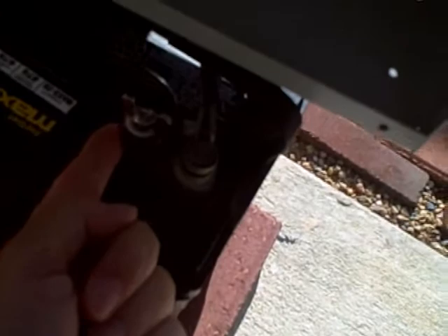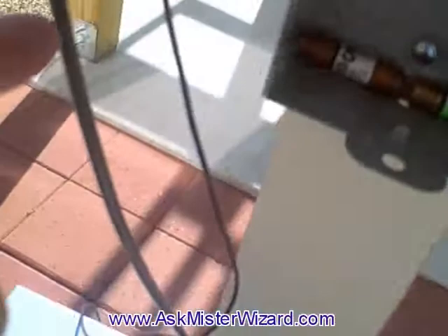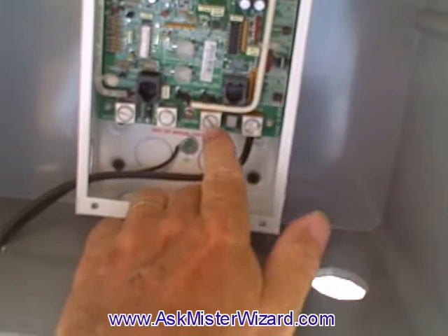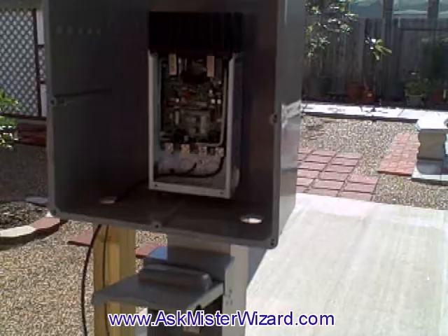10 minutes later, I've connected a heavy black wire from the negative terminal of the battery, routing it up and into my charge controller at one of the negative common leads. That's just part of our plan — all of the negatives are going to go here on these two connectors, all held in common, both from the battery and the solar panels.